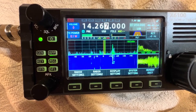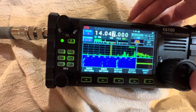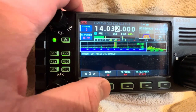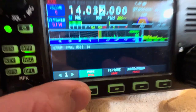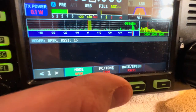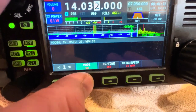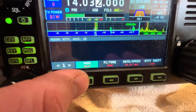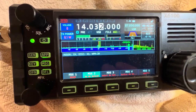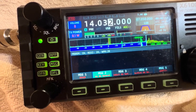Not only that, but you can go down here where there's CW or different digital modes. You can click App → Modem. You can be in CW decode mode, BPSK, RTTY, or PSK31. I keep it usually in CW mode. Then you click Message and you can send out messages directly from this radio in CW, which is Morse code. Not only that — RTTY and PSK31 as well. Isn't that just amazing?